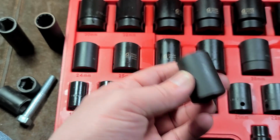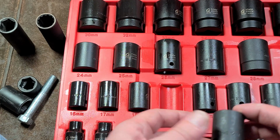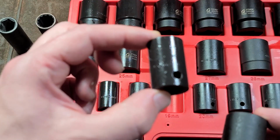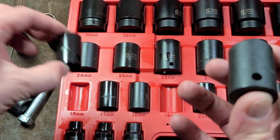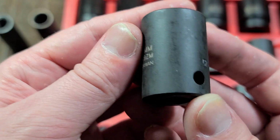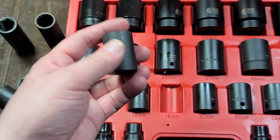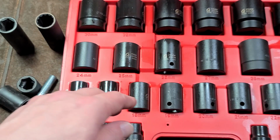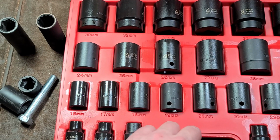And the final note here is people have talked about, even in some of my videos, that the sockets look plasticky. They look plasticky because they're oiled. When you oil the industrial carbon finish, it gives it a sheen. As you can see, that's the way this socket started out. Now that I've handled it, it has the same old dull, traditional industrial finish that you've come to expect. So yes, new impact sockets will look plasticky because of the oil.